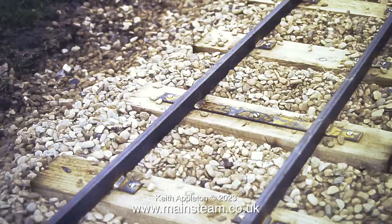400 feet of this material was laid in position and then covered with 20 tonnes of gravel ballast. Once the ballasting was complete and Chris was looking even thinner, it was time to source the sleepers. Initially, pricing these from a specialist supplier, the cost seemed prohibitive. The solution was to buy tannalised 4-inch by 1-inch timber from a local fencing manufacturer, who also cut them to the required length of 13 inches and treated the cut ends. When the sleepers were laid in position, the railway was beginning to take shape.